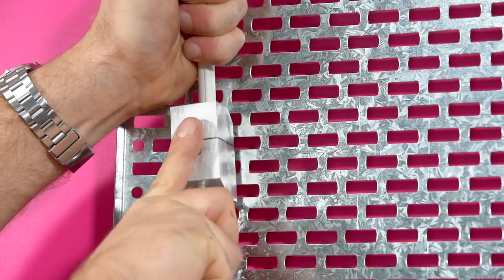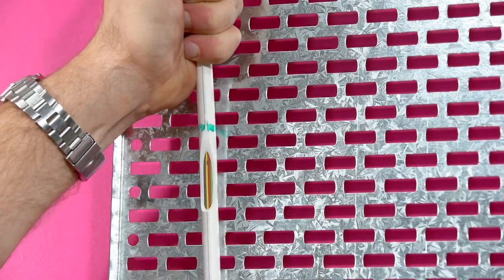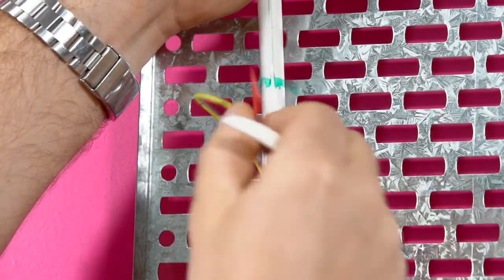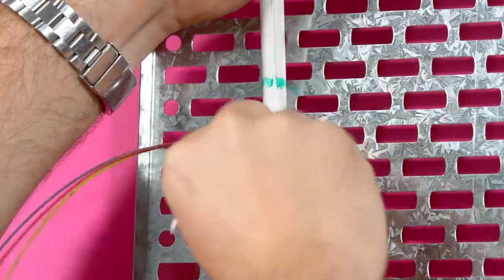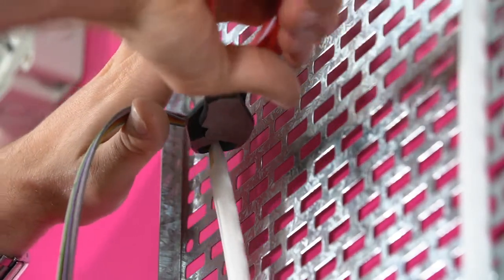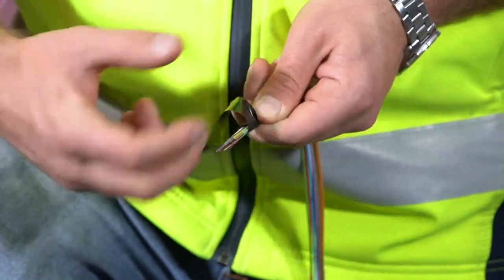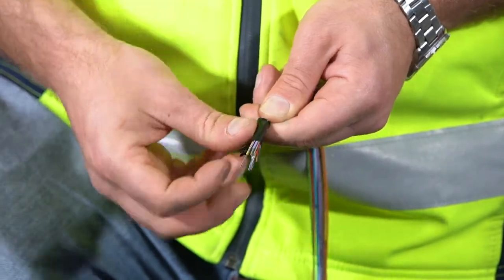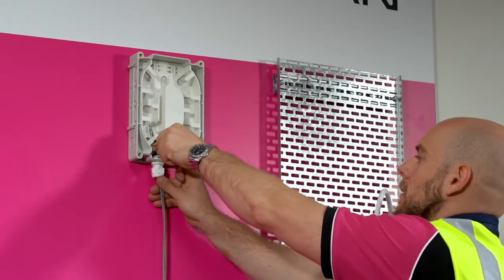The scallop should be made over one of the ridges running along the cable to avoid cutting the strength members. Place the tool on the marked line and apply light pressure onto the cable to cut into the sheath. Pull the tool down the sheath and out. Using the scalloped sheath piece, pick out all the fibre modules. Once all the modules have been extracted, cut away the sheath at the scallop area. Tape the modules together, avoiding any excess force that could damage the fibres.